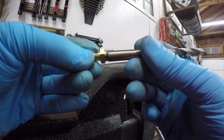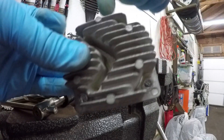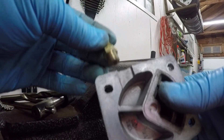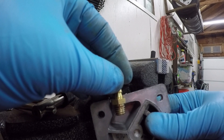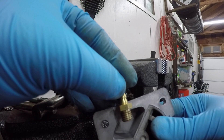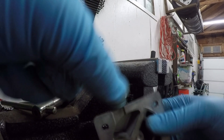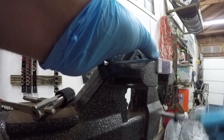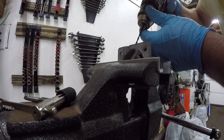As a final sanity check, double check your alignment of where this thing is going to be sitting. I just physically took that barbed fitting, placed it where I thought it would go, figured out how deep it would go past that top metal surface if screwed all the way down, and then checked the inside to make sure there were no castings or edges that this would bump into. Really take your time with getting that placement right — this is a pretty important step because if you don't do this right, you're probably not going to have a good seal there and air is just going to get through. But once you have decided on that final placement, you are ready to pre-drill that first hole. I put this in my vise for a couple reasons: first, the hole would be more perpendicular — I could get it straight up and down and that will help with sealing later. Second, if this piece is locked in place, I can be a lot more precise with where I'm drilling.